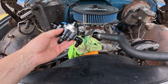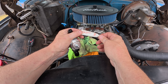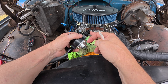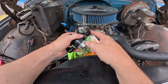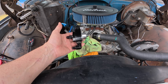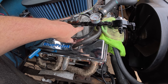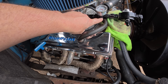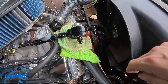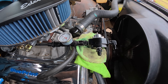Got all the fittings on the regulator. One more little detail: use a thread sealant, not tape. Tape tends to break off, especially if it gets inside the thread — you don't want it interfering with the 37-degree flare, and you don't want it breaking apart and heading into the carburetor. Bad things happen. So always use thread sealant on fuel system AN hoses. I think I can reduce the length here — the way I've got the gauge and two couplers set up it's just made it too long. I'm plenty clear of the fan, but I want to bring it in a little bit closer to the engine.